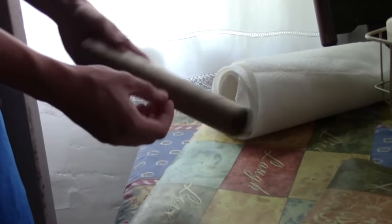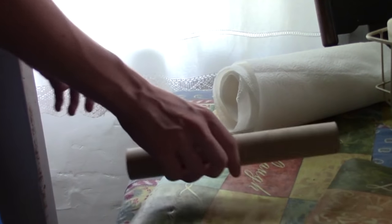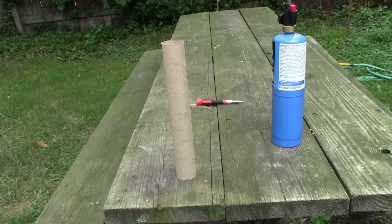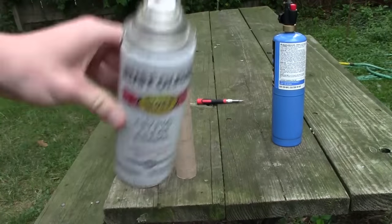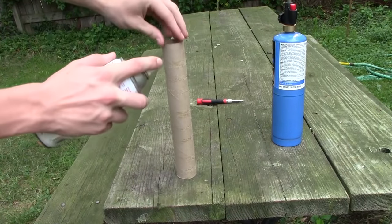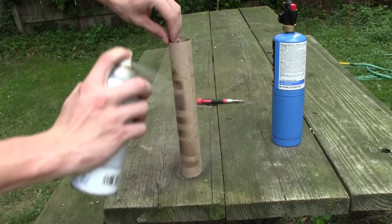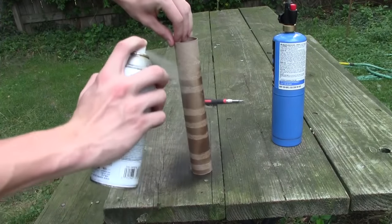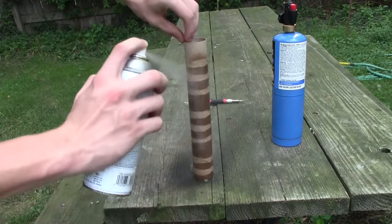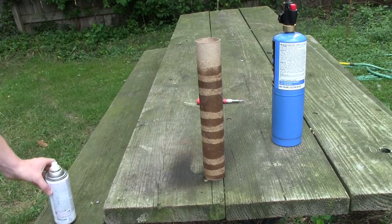The first thing you're going to want to do is find an old paper towel tube. We're going to use that for the secondary coil. It's important that you get this Rust-Oleum crystal clear enamel — this stuff is going to save you so much trouble. You want to spray down the paper towel tube and get a nice coat on it. That's going to help stabilize it and give it some insulation so that your secondary coil doesn't catch on fire later on, which it can, so be careful.